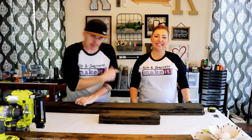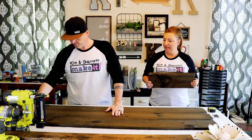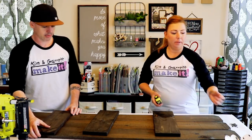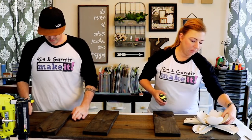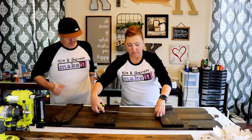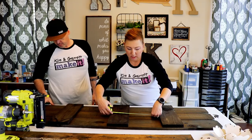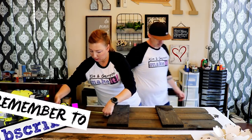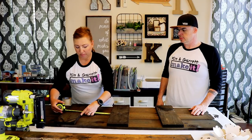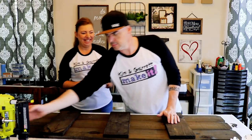Step four: assemble the pickets. We're gonna lay them out and lay down these braces. We have this flower we're gonna put at the top, so I'm gonna measure down from where the flower is going to sit — that's where the first pot will go. Then I'm gonna go eight and three quarters between each board, and that should have the last pot close to the bottom but not touching the ground.